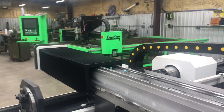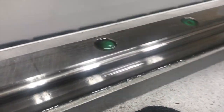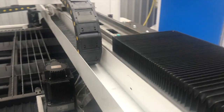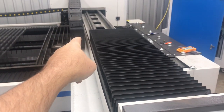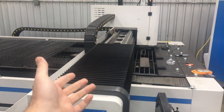I was looking around and removed the dust cover because I remembered, when putting this together, seeing the limit switch wires feeding in here. Looking down inside, right there — I don't know for certain if that is the issue, but it very well could be. What it is is the limit switch wire wedged in between this cable trough and the casting of the gantry. Whether this is the issue or not, it needs to be fixed. I'm going to pop these covers off, get that loose, splice it out, and reconnect it where it got pinched — because maybe that's the issue, pulling a hot wire to ground and bringing that whole board down.